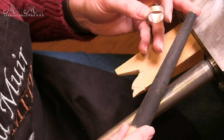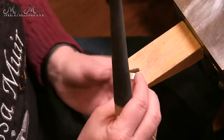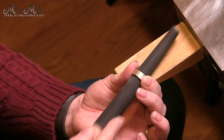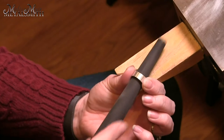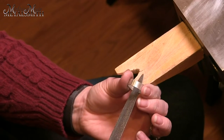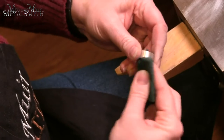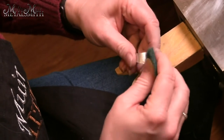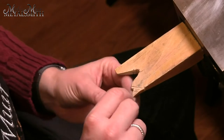One of the tools I like to use to get on the inside of rings is a cone with sandpaper adhered to it. I'll put this on here and use the cone to come in and clean up that solder seam. Make sure I turn this over and do it from the other direction as well. Then I'll use my Scotch-Brite in here to clear this out and give a more uniform surface. Now we're ready for the next phase.